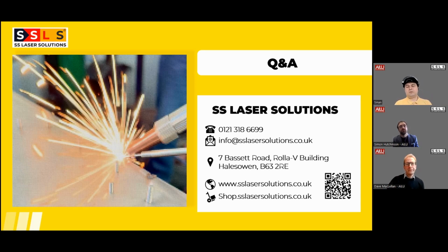So our approach at SS Laser Solutions is, if your process needs anything more than 2 kilowatt to weld anything thicker, don't go with a handheld version, go with an automated welding solution, which we have. Then we can eliminate the operator from the process. So that's going to be a class 1 laser rather than a class 4 laser. So that's the answer.